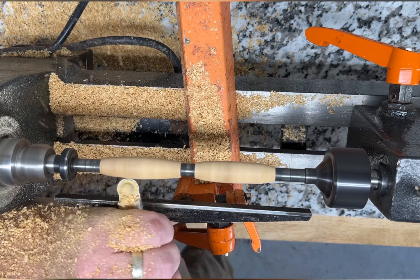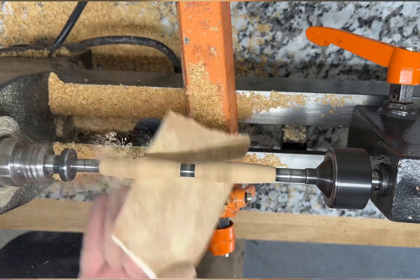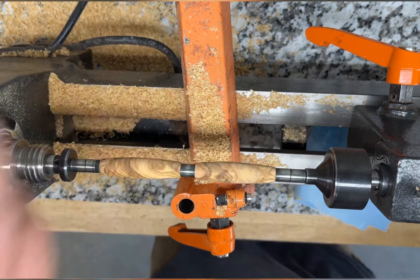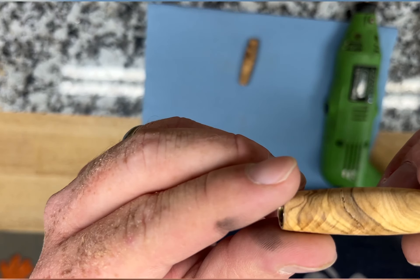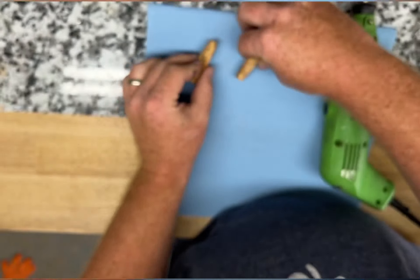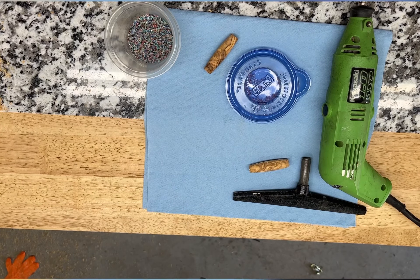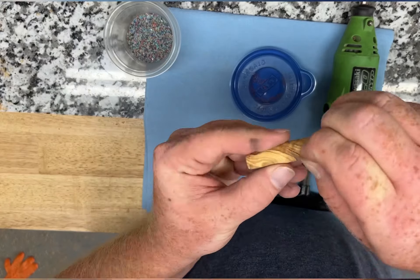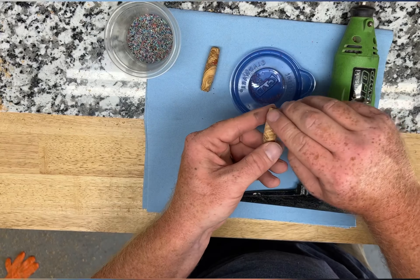I like these to be a pretty low profile in the final product. You get a lot of heat from sanding, so I always hit the blanks with denatured alcohol before I engrave them just to clean them up. Here you can see there are a few little superficial cracks — these are just wood grain cracks, not from turning. I like to clean those up before I start engraving by inlaying the cracks with some fine opal and a thin CA glue to fix it in place.